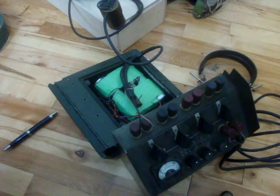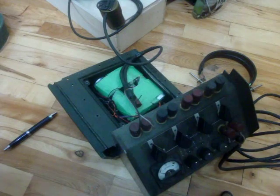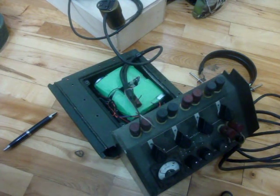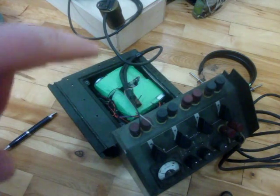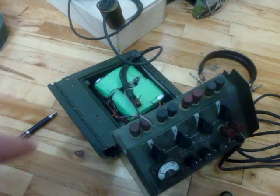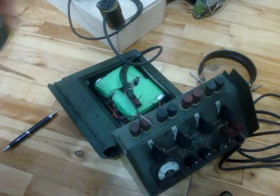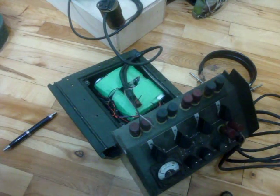Alright, I was looking around for a clip for this thing, and it's proving difficult to find. The only place that had one wanted to ship it for $40, and for a $2.75 item, I really don't think I want to spend $45 on it. So I just took my batteries, because I wanted to test the unit out, and connected them all up in a series setup. I switched the middle set around so that it could run like an S, and I wouldn't have to connect all the wires to the system. I just ended up connecting the positive, negative, and the one that goes right down the middle. Cheap little pack design, but it's just for a test anyway.